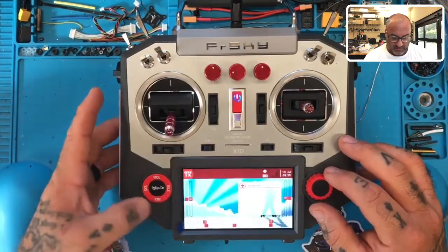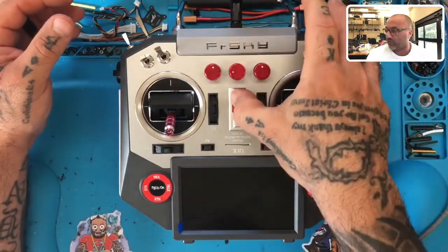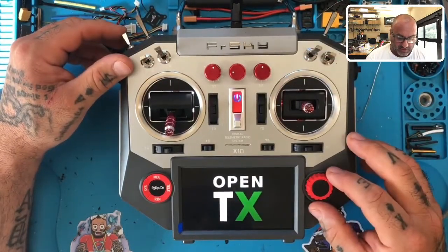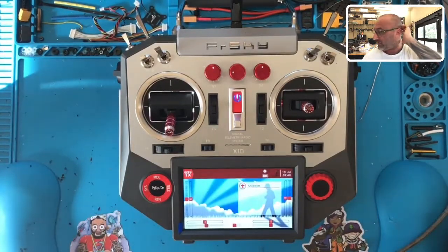That should help. We don't have the throttle error now. This was set to Mode 1 and none of the rest of the setup had been done. The throttle warning's gone — it's only a failsafe warning and that's fine because failsafe hasn't been set up yet. Go back to the website, see the link below. If you have this problem and your access module upgrade isn't showing up, download the firmware from the page, install it, and you'll be good to go. Make sure you've done your OpenTX firmware properly as well.